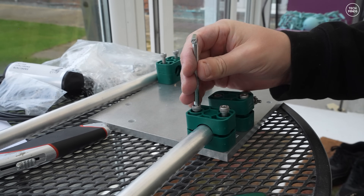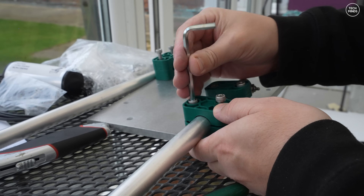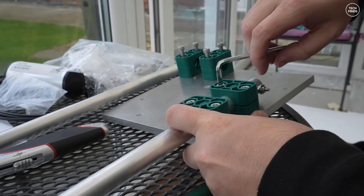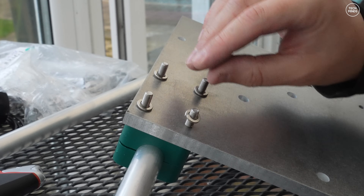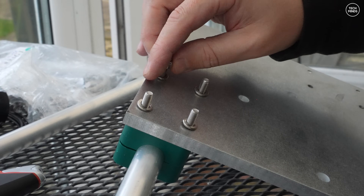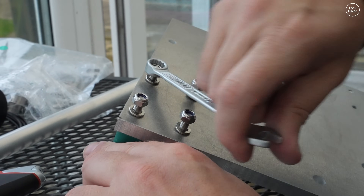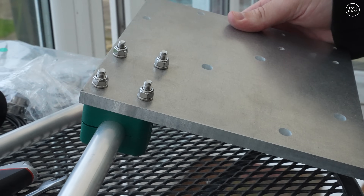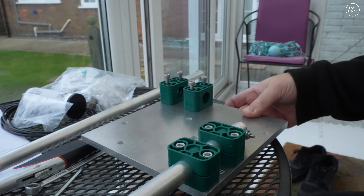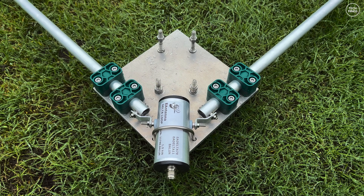I left around one inch of clearance and then nipped up the bolts to hold the spreader elements in place between the green clamps. The included allen key is a nice touch for screwing those bolts through the green clamps into the support plate. As mentioned, those bolts go entirely through the support plate — even though it's threaded, you still need to attach the washers and nuts on the underside. These are nyloc lock nuts, so they only go on so far by hand; use one of the included wrenches to tighten them fully. I'd recommend only doing this once the balun is fitted.